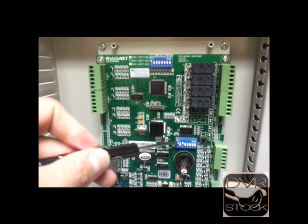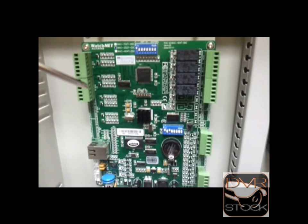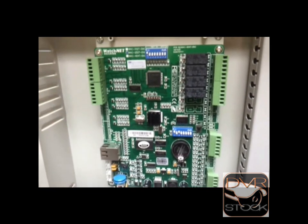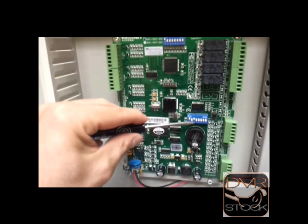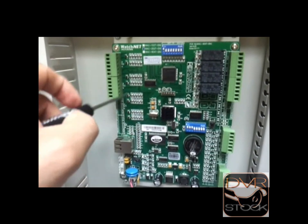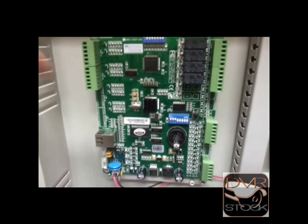This other DIP switch — 1 through 3 — is to configure the IP of the panel. But first it will scan the MAC address of the panel on the software, and then we will configure the IP. If we already configured the panel and forgot which host the panel is hooked up to, we put DIP switch number 2 ON. We take power OFF and ON, and make another scan for the IP. It will show you the default, which is 10.1.1.10. We configure our IP, which we'll talk about in the next video.